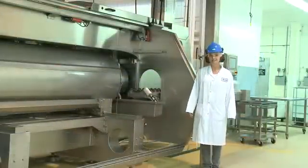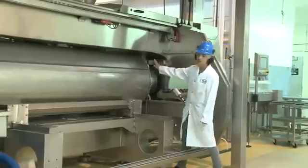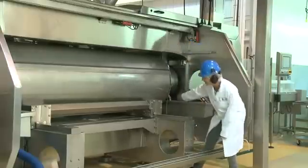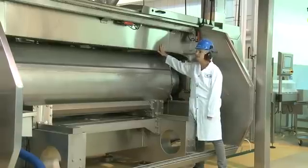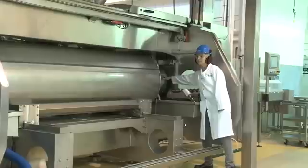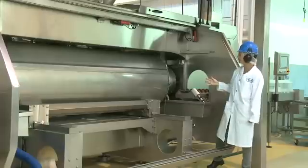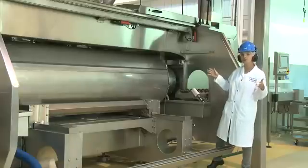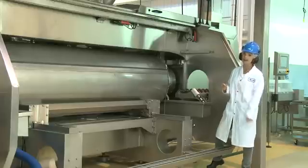Now that the pressure vessel is in place, we'll take a step back and look at the entire piece of equipment. We've got three main components: the first being the pressure vessel, the second being the yoke — this thick piece of metal that surrounds the entire pressure vessel, constructed to withstand over 4,000 tons of pressure. The third components are the plugs on either end. Those go into place as the vessel fills with water, and behind the plugs comes a locking mechanism. The yoke holds those plugs in place so when the pressure increases, it allows the high pressure to be established within the pressure vessel.